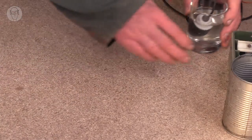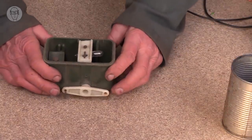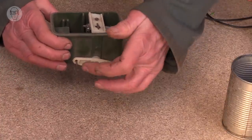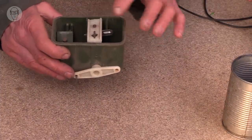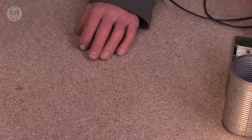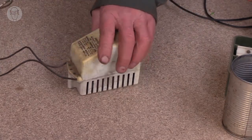Well, these sensors come in lots of different shapes and sizes. This one's actually just like the one in my loft for switching the pump on, because we're on a well. And there's a float on one side and a weight on the other. And the float tips the switch over, the old mercury switch in there, and that switches on the pump. This is one, I don't know what this is, from the bottom of a pond or something. There's a float inside there which tips up.